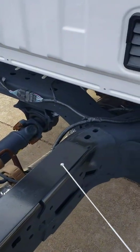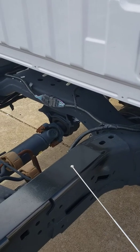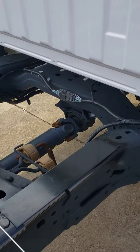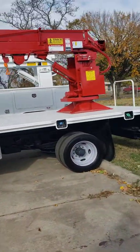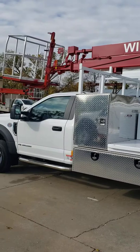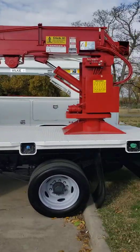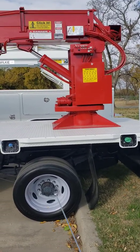I'm going to move over here to this other bed and show you one that's mounted up, to explain a little more on how we build our beds to ensure long life and durability on your equipment. You'll notice on this — this is a Wilkie model 52XLR on a F550 — we build the equipment with the base behind the rear axle.